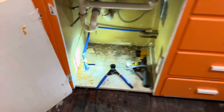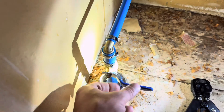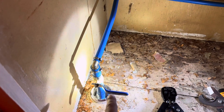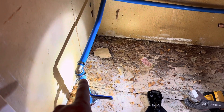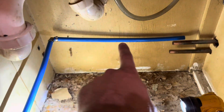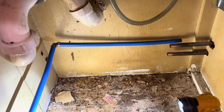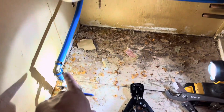I'm going to take you guys in close now and show you what's going on. The water comes in right here — you can see behind me, this is where the water kicks in. It's insulated, but that's a blue PEX pipe coming in — that's why I cut the floor out. It runs over here, kicks up right here to a shut off. Now we need to run it from here. We went from three-quarter to a half inch right here, crimped, using iCrimp and Plumbing Cell. Links in the description below for these websites. We went around — there's a 90 back there — crimped. I put all these pieces together and measured everything out here, and then I just crimped this last piece.